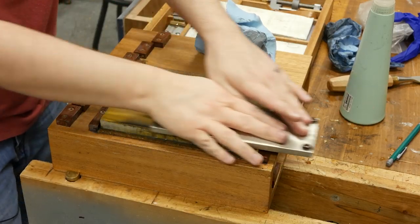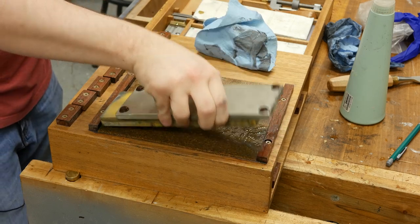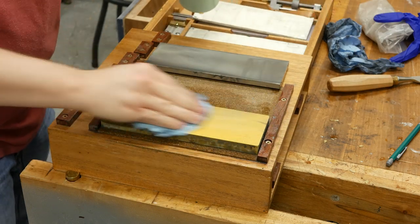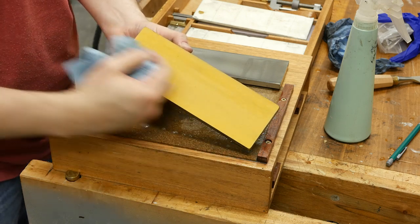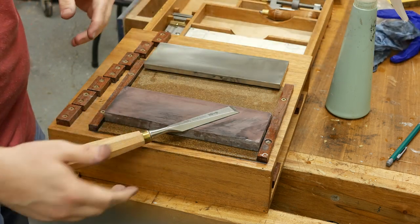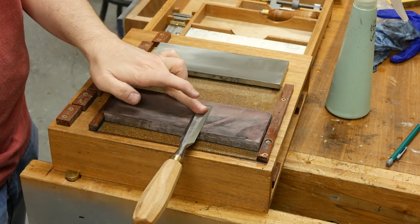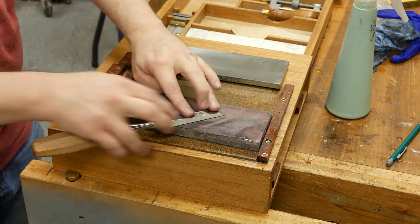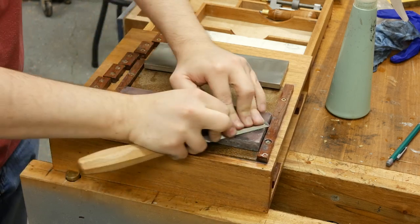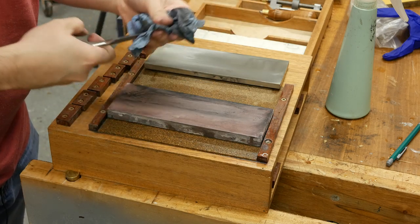After each use, I'm going to flatten the stone. Just spray water on it, turn the coarse stone upside down — it'll stick once you start to flatten it. You'll know it's flat when all of your markings are gone and you've got a clean surface. Here's another tip: if you're unsure whether you're removing the scratch pattern from the previous grit, try angling your chisel on the next grit. For instance, I went perpendicular on the 1000. On the 5000, I can angle it and go diagonally. When you're done, look at your scratch pattern — if it's diagonal, that tells you you've polished enough.